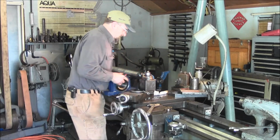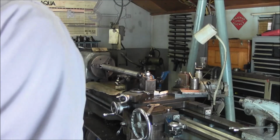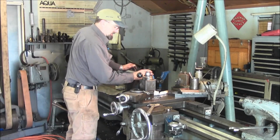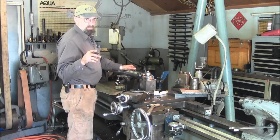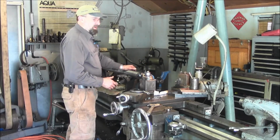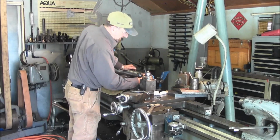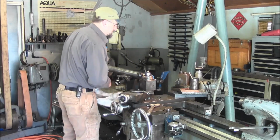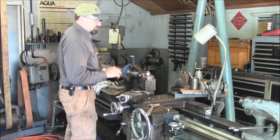Oh, okay, there's something a little funky there on the end, and that is a virgin end of a rod. Sometimes the blunt end of a rod, of course, the material house is going to sell it to you because they want to make the money. They get X amount in their rim. If you're going to eat up half a bar, they want exactly the other half of the bar, type of thing. So anyway, let's go ahead. We're going to put a center drill in here, and then we can skim a hair off of there if we have to, or hand draw file it.